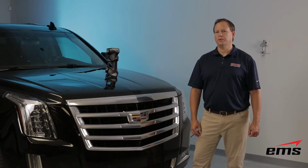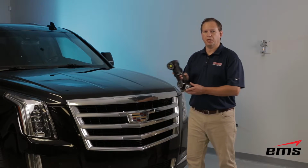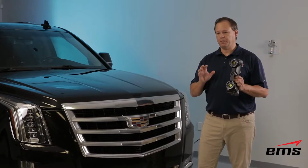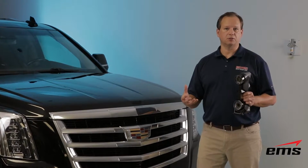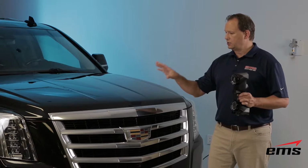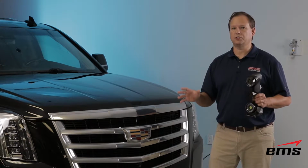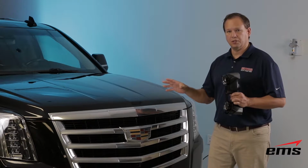So for this video, we chose the new Creaform HandySCAN Black 3D scanner. The reason we did so was a few things. One, portability. Most of the people that are doing this type of work need to go out to a car lot or a dealer and scan the vehicles right there on site. Many times they're outside. Also, as you see here, this vehicle is black with a lot of chrome. We've got some translucent surfaces, and it's large. So that's about all the challenges you're going to run into. So we'll see how well this scanner does on a vehicle like this.